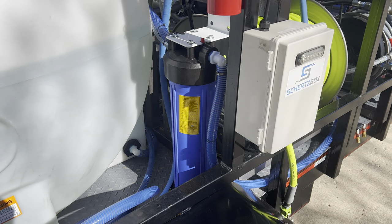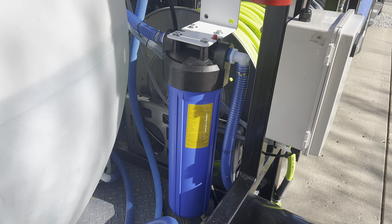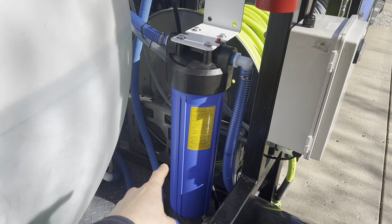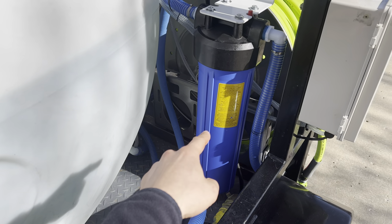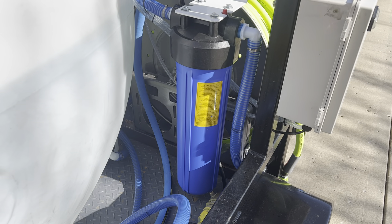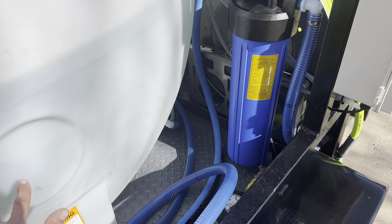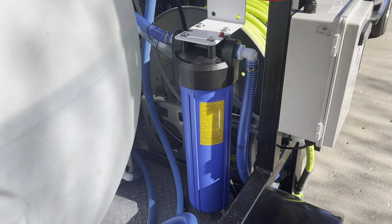This is a 40-gallon-per-minute house filter, and this is what I use to filter the water in my rig. When water comes through the meter, hose, and reel, it passes through here. Inside it looks like a pineapple with the outside cut off — the filter is a plastic woven fabric material. It lasts over a year, traps sediment, scaling, and calcium, protects your equipment, and leaves the water cleaner so it doesn't spot as much on windows. At 40 GPM rated, you won't lose any flow.